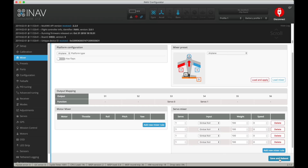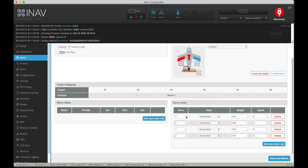So we save and reboot that. With the next version of the firmware — 2.1 board firmware — you'll only need two of these lines, and you'll need to drop the second line down to about 40 or 50 or something like that.